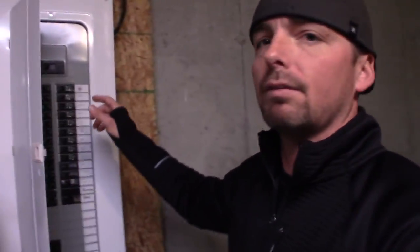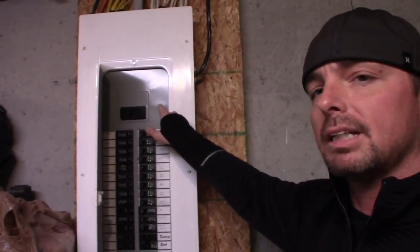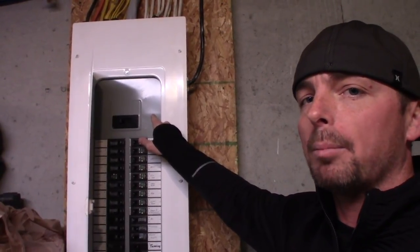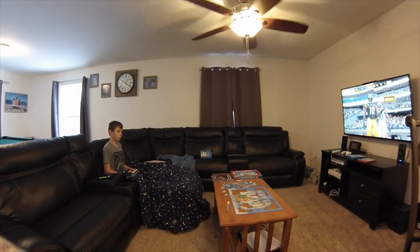What we're going to do right now is something a little fun — we're going to simulate a power outage at my house by throwing the main breaker at the very top of the power box. That's also a very important step if you actually lose power: you need to disconnect your main breaker from the power pole outside. In no way do you want to be back feeding power into this panel, into your main breaker, through your power lines and up into your transformer on your telephone pole. That can create very dangerous situations for linemen working to restore power and could cause damage to the transformer. My kids are upstairs using electricity right now, and we're basically going to get the house back up and running on generator power.